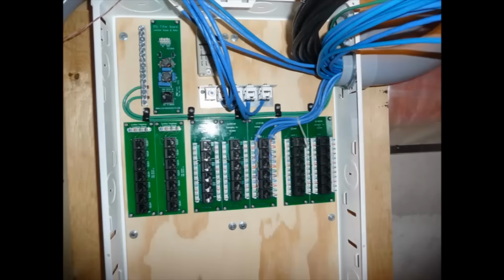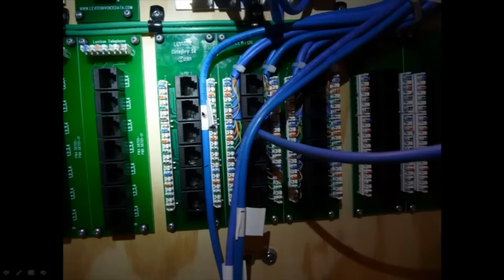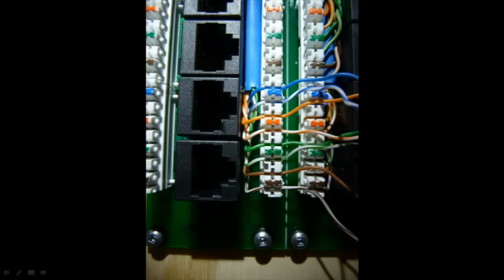So I brought some of these wires down. I'm starting on the room drops first. All the wires are coming down onto these center boards. You can see on the left here, I'm coming down onto this side. As I brought the wire down, I put a little notch where I had to cut it. This is the jack for one port here, another port, and the third port here. So there are 3 on this side and 3 on this side, and they serve the 6 jacks in total. Once I had it cut, I lined all the wires up into their respective channels.